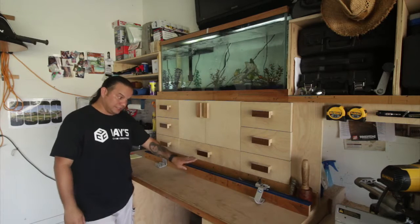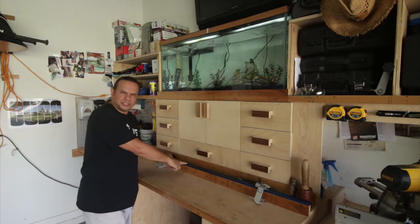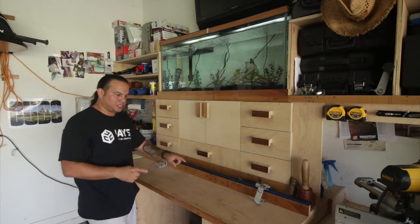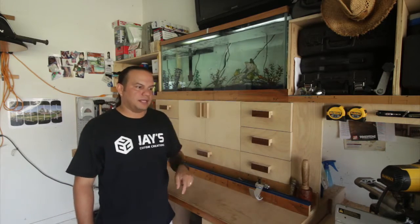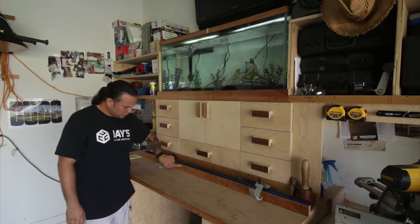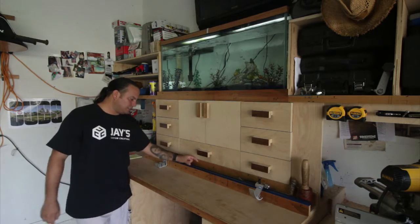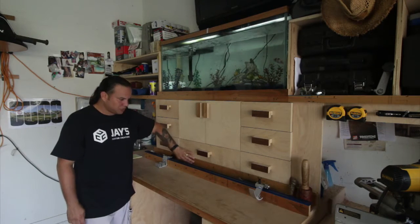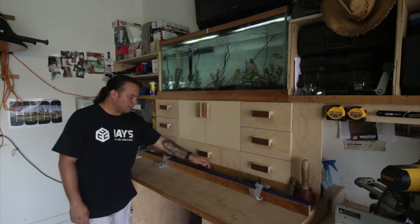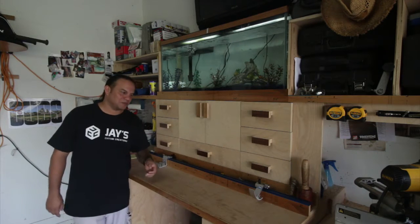This section down here is another part I absolutely love — this is my horseshoe stop block system. I'm using the Kreg Precision Measure System Kit, which comes fully loaded with the tracks and these two stop block pieces. I actually bought an extra one for the end cabinet horseshoe stop block so I could use it over there. Everything else I had to build to spec — I think it's about two and a quarter or two and a half inches for the clearance. The depth of the channel is three and a half inches on the inside, and the wall back here is also three and a half inches. It acts like a sort of cubby — I keep small things like a screwdriver, my keys, and other items in there.